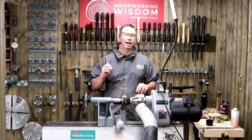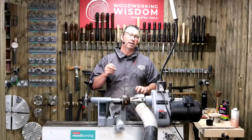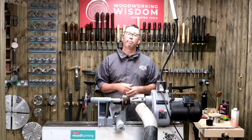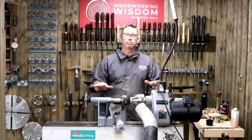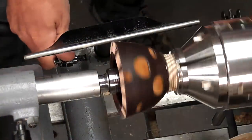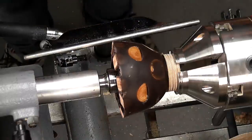And it's exactly that. If you're sanding between pours of resin, say you've let it go off too hard, then you can stop at 240, 350. You don't have to go really, really fine because the resin completely fills all the scratches and it covers them up completely. You don't see a thing, completely clear. That's what we're going to do here. So it's a nice, easy finish as well. I'm going to burn through this nice and quickly so we can concentrate on the inside also.